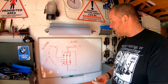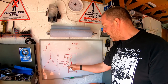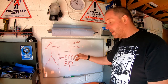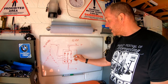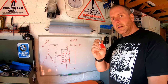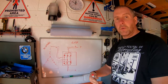That is a very basic demonstration of what we're looking at. In order to carry out our test there are going to be 12 separate tests to test each line of the circuit. We test each of the three phases in both directions — six tests one way, six the other — so we should get continuity in one direction but not in the direction where the diode is blocking flow. Hopefully that makes sense — let's get the multimeter out.